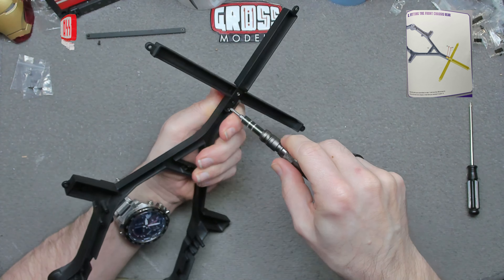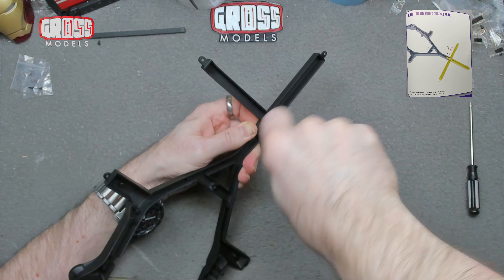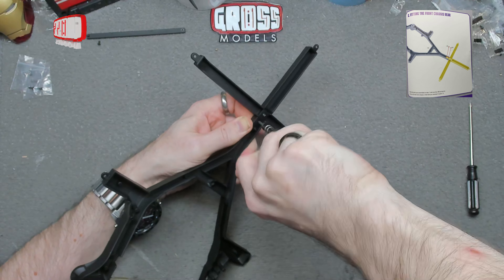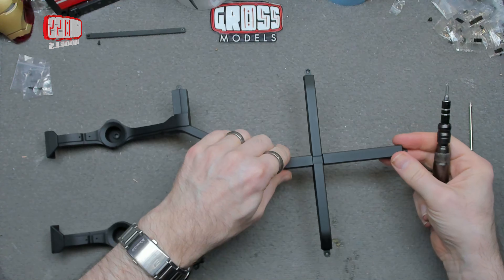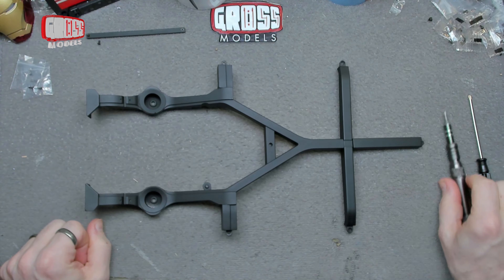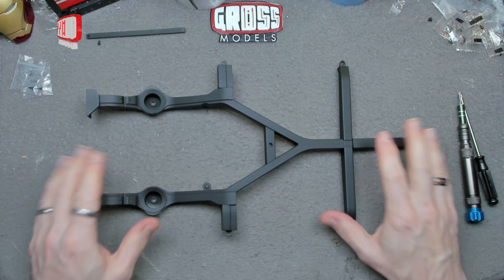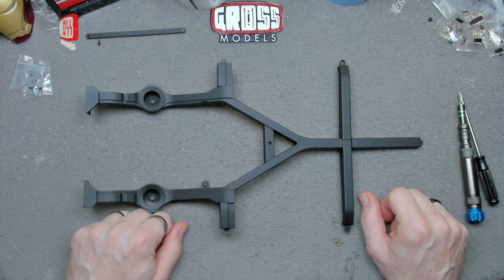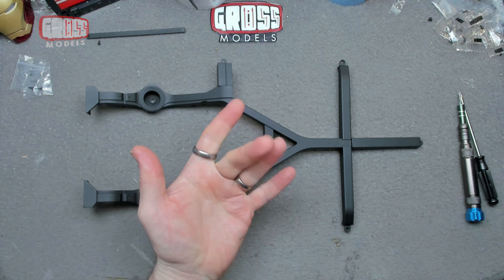The same thing applies — go forwards and then back a bit. That breaks off any debris in the thread, any paint that might have slipped in during manufacturing. It's worth alternating between screws — get them both tightened down in concert rather than tightening one fully and then the other. It's nicer on the parts and keeps everything lined up properly. That is another issue complete. I think we're going to continue building this up for a few more issues yet, so thanks for sticking around — I'll see you next time. Thanks for watching, bye!